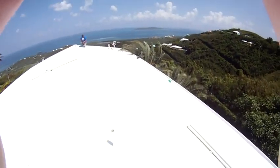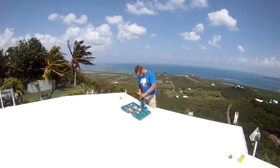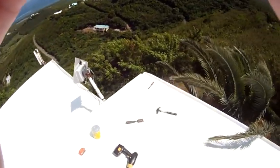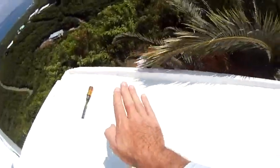Here, I'll show you these crickets — they make the water flow towards the drains better. You can see he's put a cricket in here. This is a piece of plywood to the edge of it. This whole area has been added to force the water to drain down towards the downspouts.